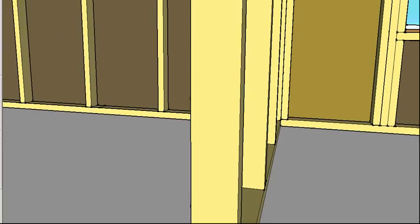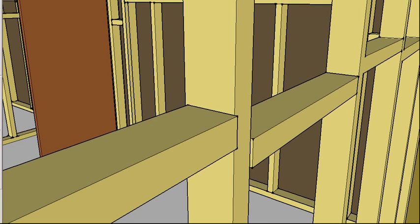Used to use an air stapler, staple them on, and then give them a touch with the electric plane. The staples would do minimal damage to the electric plane. So that's how you feather out the ends, just an electric plane. You keep building it up until you eliminate the bow. The other option is to do what they call crippling.